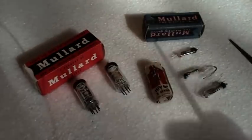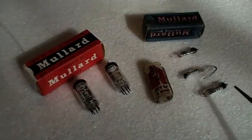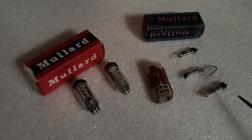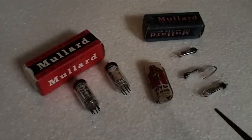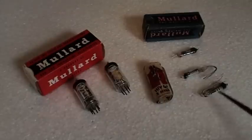On the right-hand side are some of the smaller valves used in receivers. Some of these, known as soft valves, had a disadvantage in that they didn't have a long life — typically 15 hours, and could be a lot less if you put too much current through them. That's why in early videos of people setting up single-channel radio control aircraft, you see meters plugged into the side. These were to check current flow and for tuning purposes, but also to ensure you didn't overdrive these valves and burn them out.